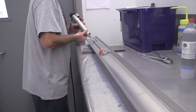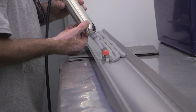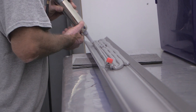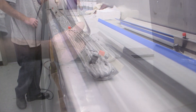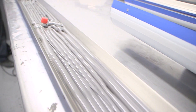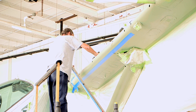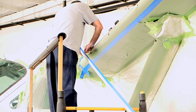On the inboard wing panels, apply type X class B sealant to all of the back surface of the panel and to the feed input and bleed valve. Approximately 65 ounces of sealant is needed to make sure that there are no air pockets between the panel and the wing leading edge. Use type X class B sealant to shank seal around each rivet and/or screw hole in the leading edge skin.